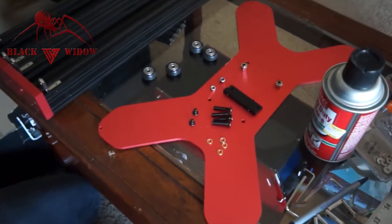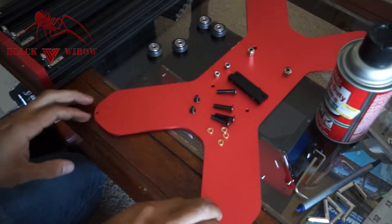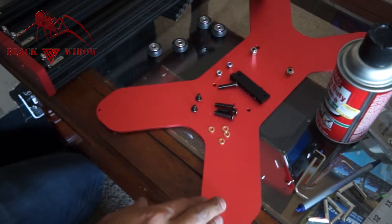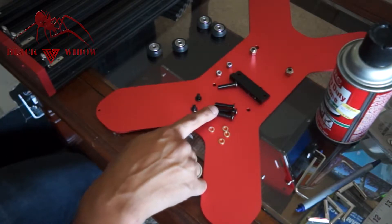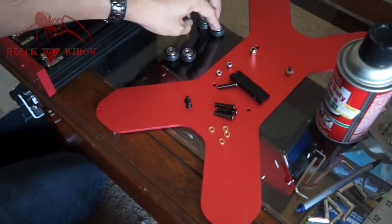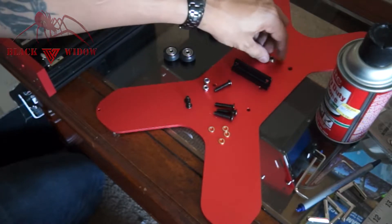We're attaching the wheels to this red anodized aluminum bed frame plate. Don't worry if you see marks — double check it's not just glue, not scratches. You're going to need four brass shims, four M5 by 25s, one M5 by 8, four wheels which should already be pre-set up, two nylon lock washers, your B10 bracket, and two eccentric nuts.